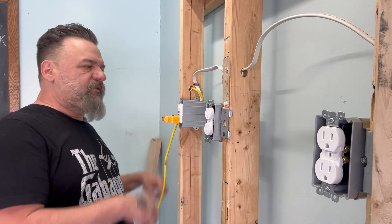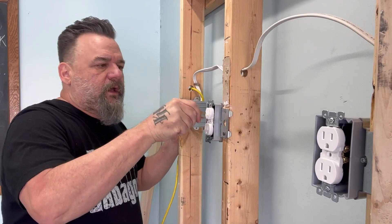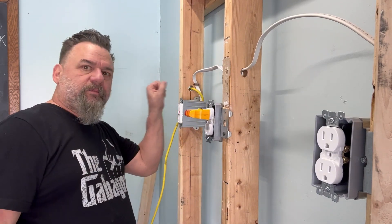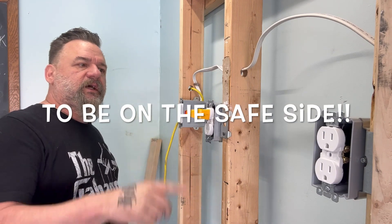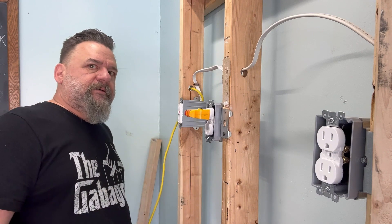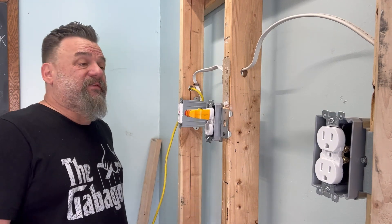Well, let's shut off the breaker. We have these, we can reset this, turn on, and we're good. Go to the panel, flip off each breaker until this goes off. Circuits out, right? Now you can never be too sure, but the circuit's off. This says it's off.